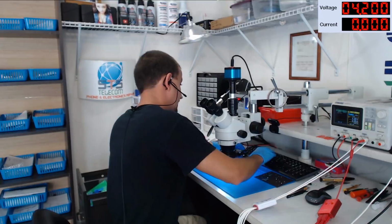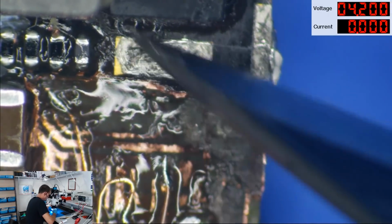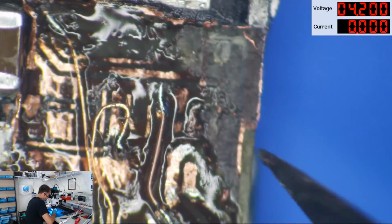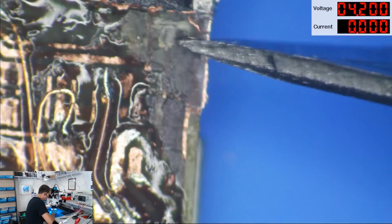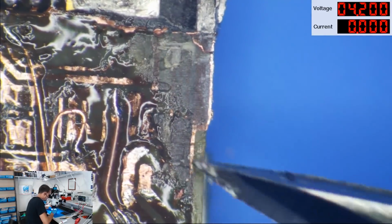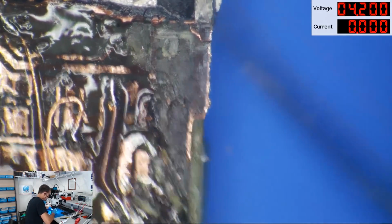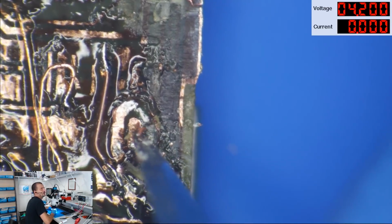I am way too backed up, and this is a nightmare. We would need to go ahead and trim back under here farther to expose the traces going here to the strobe driver. That is not too bad. We would need to jumper traces out here for Wi-Fi, front camera, I'm sorry, Wi-Fi, volume up and volume down buttons, which, since we're already torn back this far, those traces are actually going to be underneath the supply lines here for strobe, which you can see these are broken loose. See it squishing when I push on it?